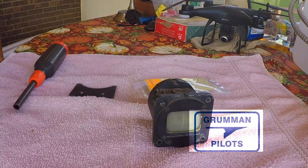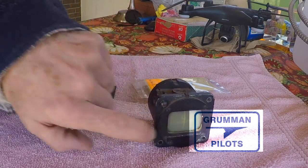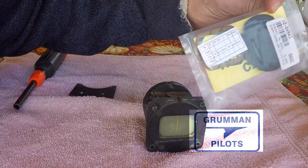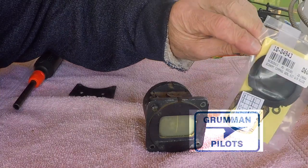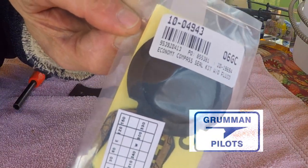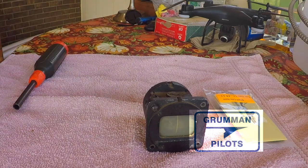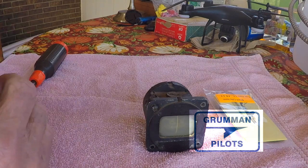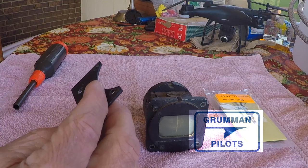Because it is a wet compass it is greatly affected by anything magnetic moving around — the screwdriver is metal as well as some other bits. The compass does have a fill on the top and cloudy glass. You can also order the kerosene from Aircraft Spruce, and one bottle is more than enough to do a couple of compasses as well as top off your entire EAA chapter.